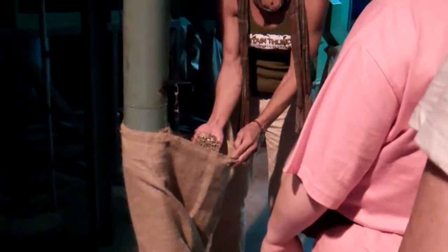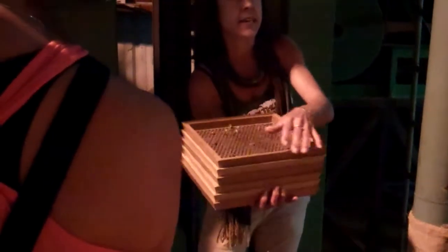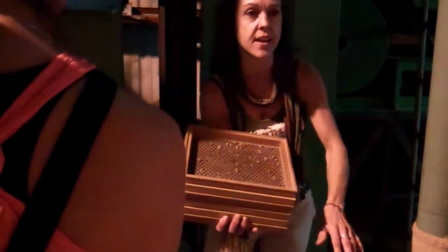Big beans, little beans, unmilled beans. Now if I want to separate the grades, I've got to size it. So we take the green bean, put it way up there, and when it falls down into the body of that machine, there is a whole series of screens in there. 20, 19, 18, 17, sifting the coffee to screen sizes.